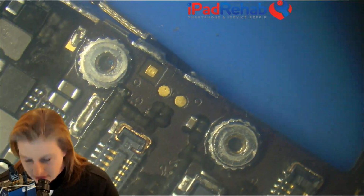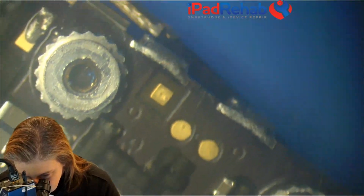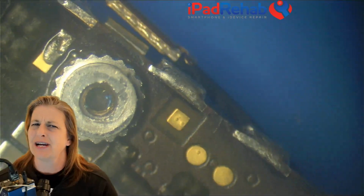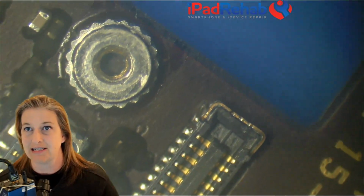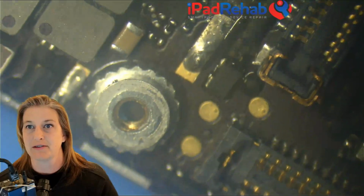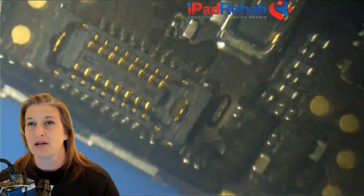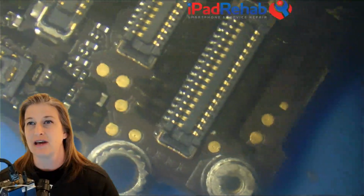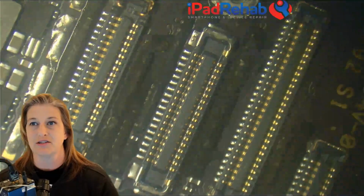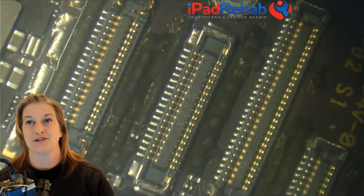And let's look for long screw damage. So let's look in those screw holes, and we want to kind of flip the board at an angle. We don't care about trash in the trash can. All we care about is, is the bottom of the trash can intact? And for these screw holes, it looks like the bottom of the trash can is intact, so no long screw damage, no sign of water damage, and no real explanation. This board should work. This should work just great.